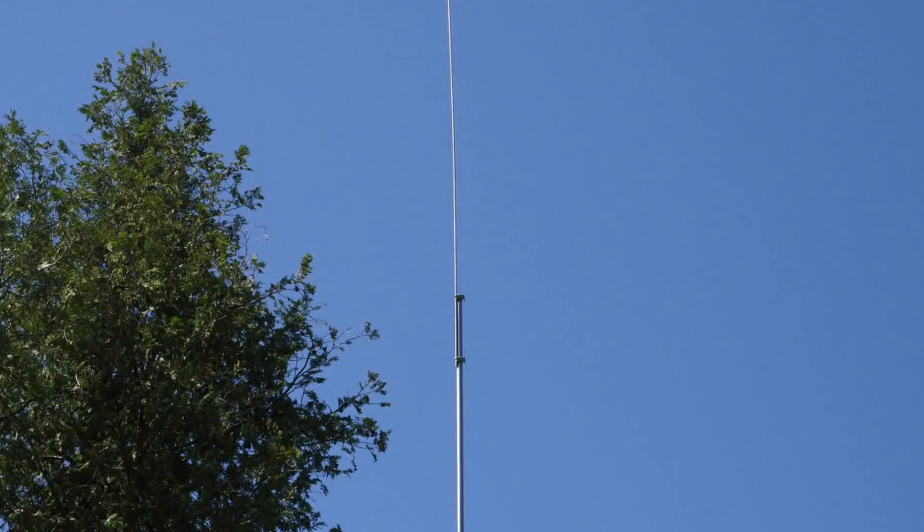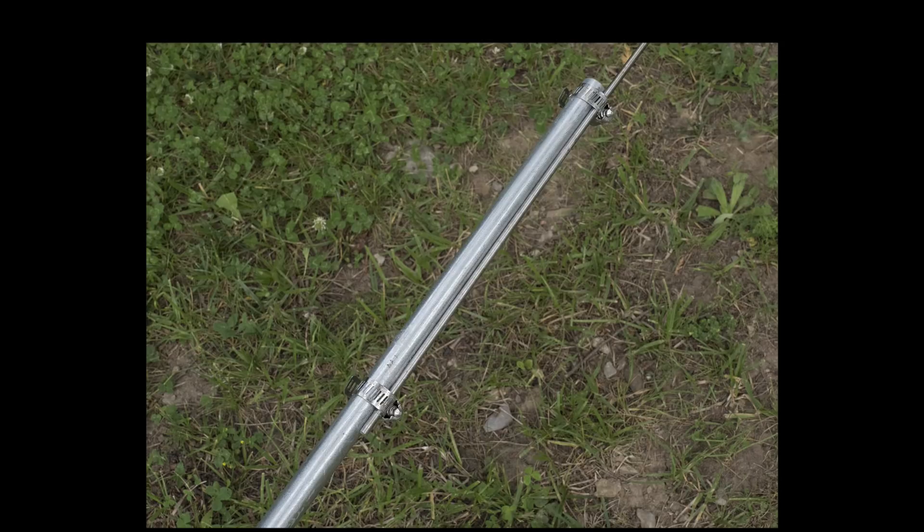Well, it's not New Zealand — I got that one the other night off the same antenna, but the camera wasn't rolling, so you have to take my word for it. A couple of things I didn't mention: the 11 meter whip up on top is held together with hose clamps, which make it easy to adjust your length. My length is 16 foot 6 plus a couple fractions of an inch. Your length will vary whether you're using the same balun I am or maybe not using a balun at all. Play around with it and you'll find what works best.